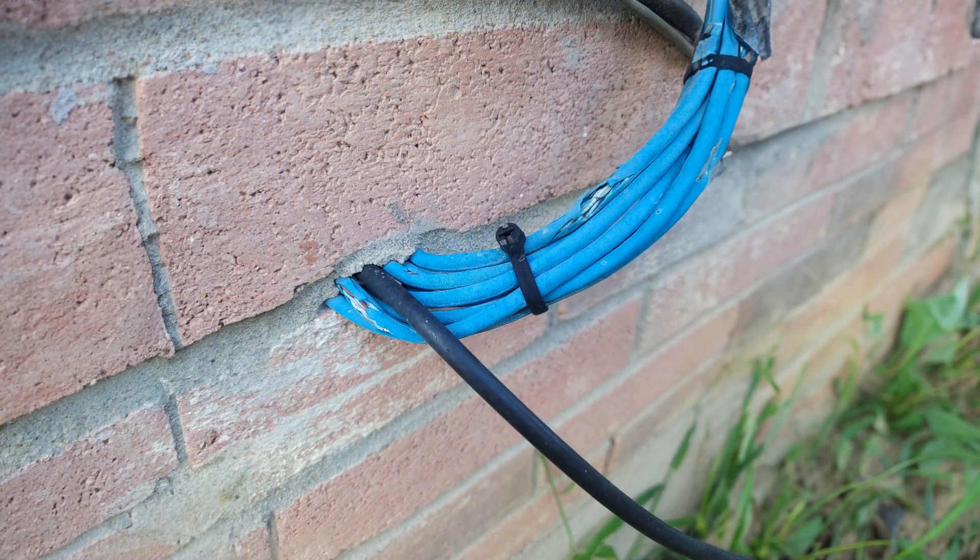So when the sun shines on it, it causes that damage to the cable. You notice that damage there in two places? Probably all these cables are going to fail here shortly. One of them, if you can see, right next to the black one, has a little crease in it and it's facing up, so it's gathering water when rain comes. And it's the wrong cable.